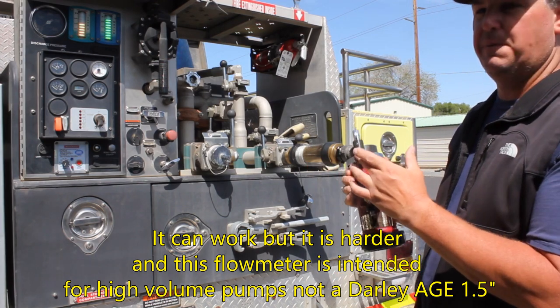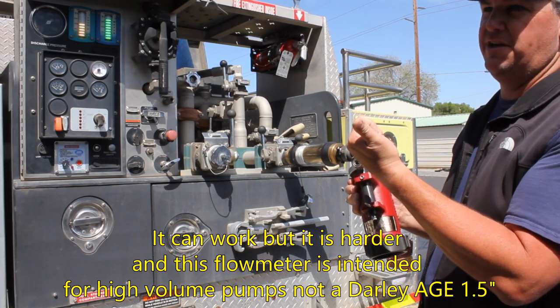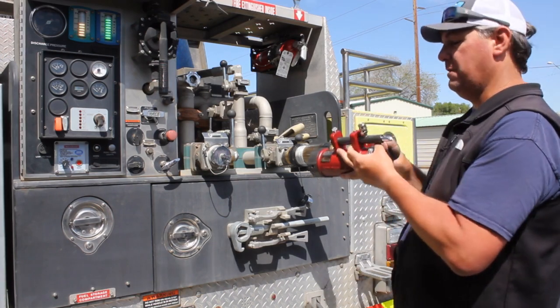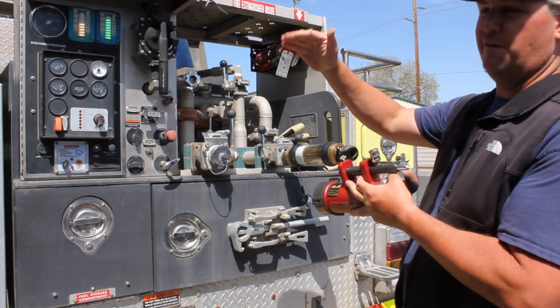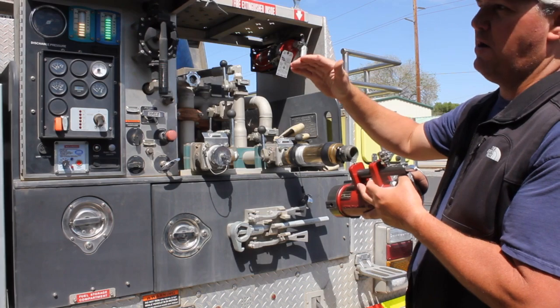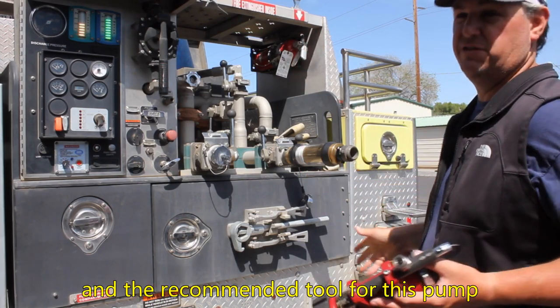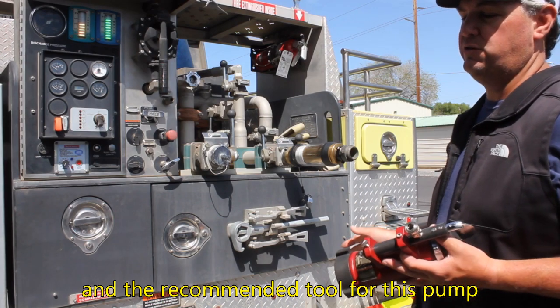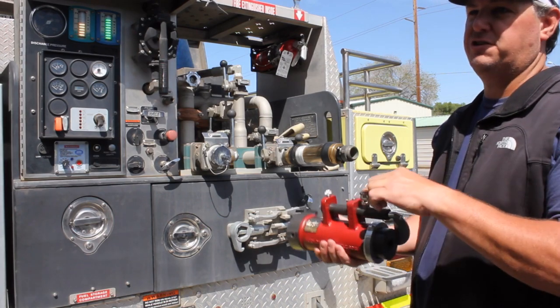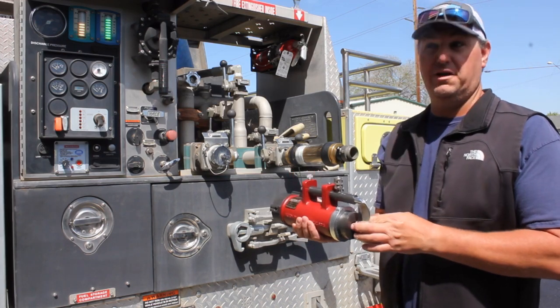Not as much because there's a big gauge that attaches right here, and I'm looking for highest pressure on this gauge. So if we were doing it with this guy, I'd be looking at high pressure on this gauge at roughly my ideal desired pressure on that gauge. This is a little bit easier. There's no calculations that go into effect later to determine that I got that for sure. But as pressure goes up, discharge volume goes up. That's just a given in the equation.